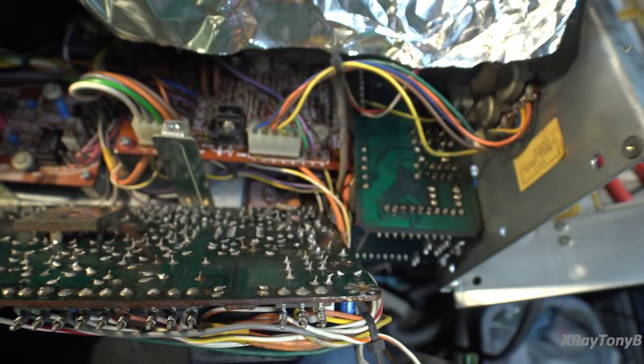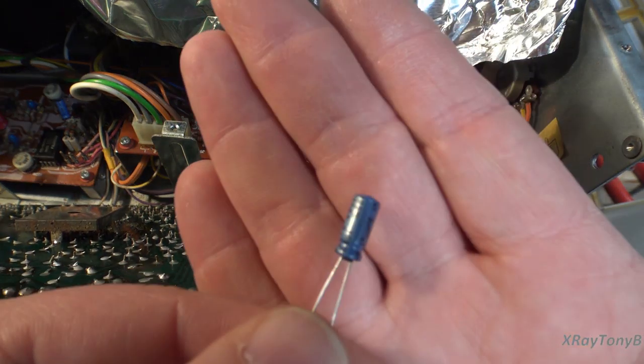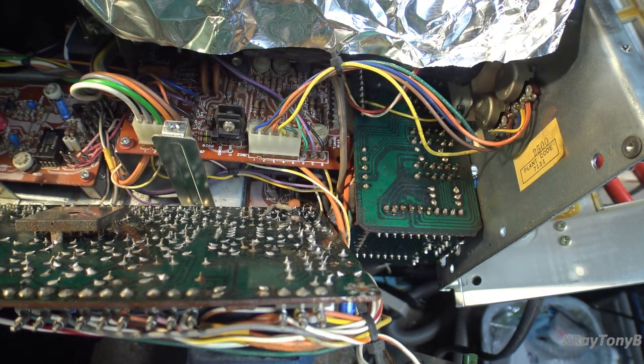If the device is being used regularly and the capacitor is used strictly for filtering a power supply — filtering ripple or holding a charge — then it really doesn't hurt to have a higher voltage cap. So taking a 16-volt and replacing it with a 35 or 50-volt cap would work just fine. Where you run into problems is when you have an electrolytic capacitor in the audio path.